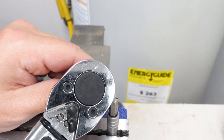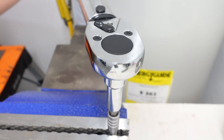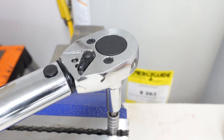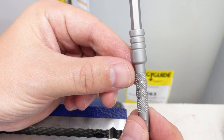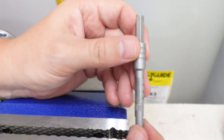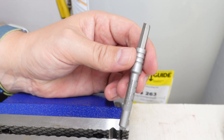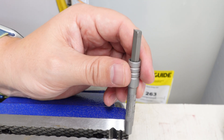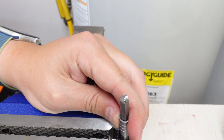I have the torque wrench set to 30 foot-pounds or 360 inch-pounds. It's not breaking — I think it's slipping in the vise. I'm going to have to tighten it up. I was stripping the knurling right off the shank of the Leatherman bit adapter. So 30 foot-pounds is definitely starting to get up there — we're just stripping the metal knurling straight off. I'm going to reclamp this and see if I can get a better bite so we can apply more torque.